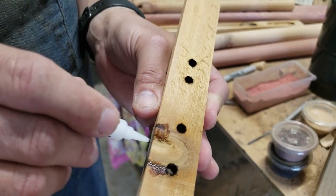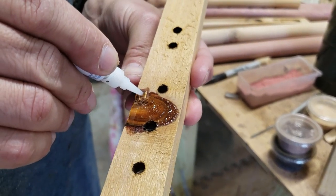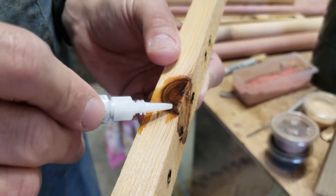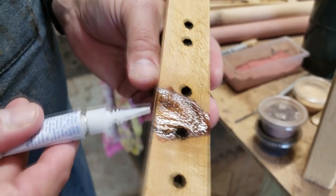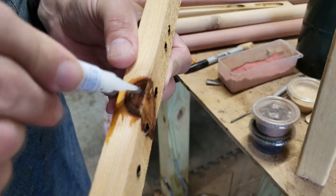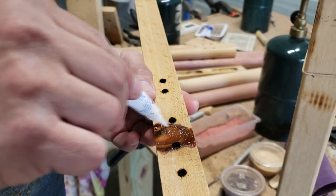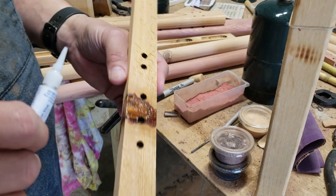There is a crack there on the side of the knot. The thing about working with knots in wood is they are a natural part of the wood. However, they evaporate water and soak up water differently than the rest of the wood does. Because of this, and the temperature change difference between a very hard knot and a very soft piece of wood, the ambient temperature will affect one over the other quite differently. So if it gets a little cold, this here might shrink faster than this, or vice versa. Putting the super glue on it seals it from any moisture soaking in and helps to stabilize it, as cyanoacrylate glue is very thin, viscous, and can soak and penetrate into just about anything. So that's a good way to seal a knot — after it dries, you can go back and plane it and it shouldn't fly out. 99.9% of the time it shouldn't fly out.